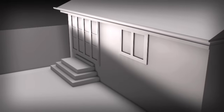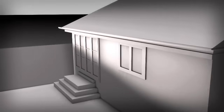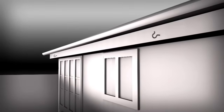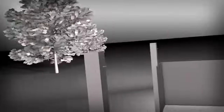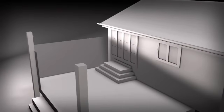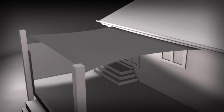For this house, we're going to attach a rectangle shade sail. So what we need to do is attach two fixing points to the house, then concrete in two timber posts at the end of the deck and attach the fixing points. After that, we simply attach the shade sail to these fixing points and tighten to fit.